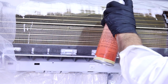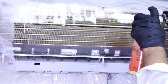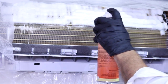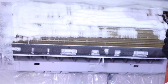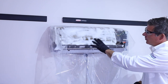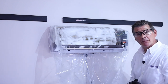Ideally you want to do this when the unit is being used because you want some condensation on the coil initially — that's going to help the coil cleaner do its job. When you're spraying the coil cleaner, start from top to bottom and make sure you try to avoid all the electronics and wires off to the right side of the unit. Other than that, make sure you've shaken the can of coil cleaner really well and that you have gloves and eye protection. As you can see, this has done a really good job of foaming up.